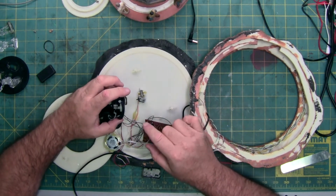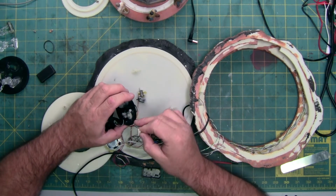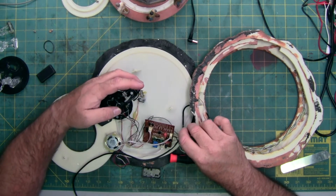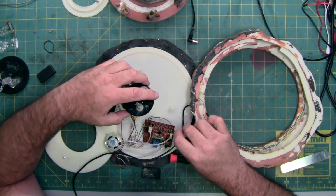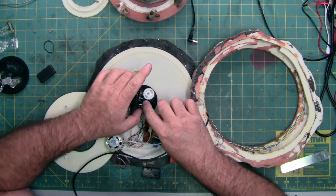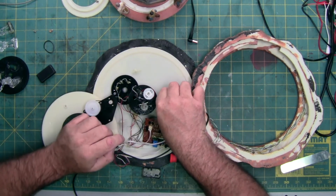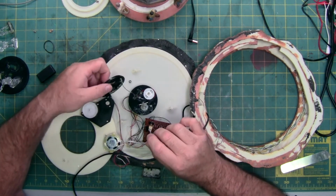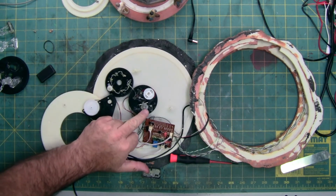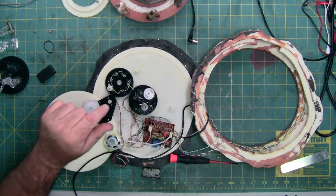When I took this apart, unfortunately, the gear that transfers over fell off. Here it is, stuck to the bottom. There you go. This gear goes on this pin right here and sets in here, which takes this little itty bitty 8-tooth and transfers the power into this base gear with a worm gear that makes it go up and down.